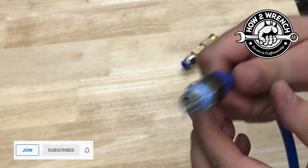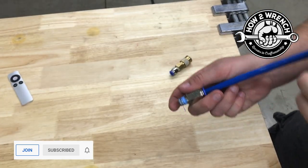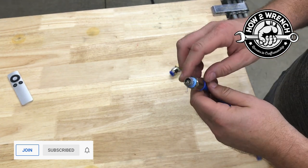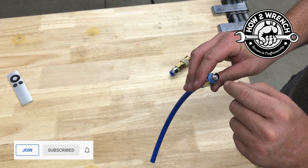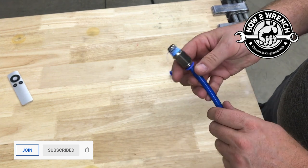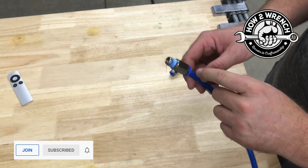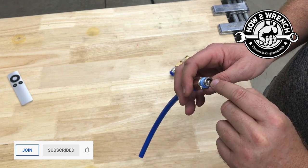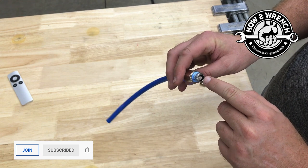You can see it pop loose. I felt the amount of air coming through there and it is definitely being restricted. This is something I would not want in there — in the majority of cases with my airlines, because I'm hardwiring them in and not looking for any kind of safety or check valve. I'm going to have to go back to any fittings I have like this and simply remove that. I'm going to grab a screwdriver and try to do it now and see how easy it comes out.